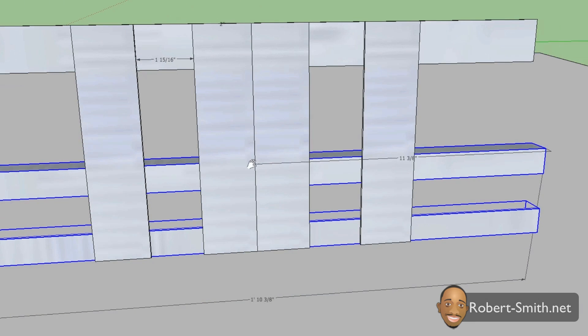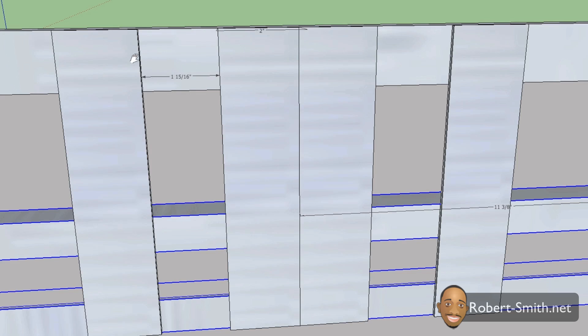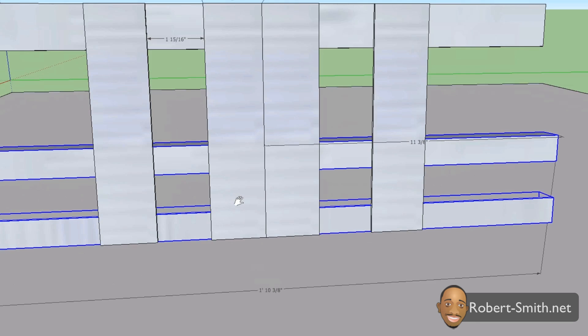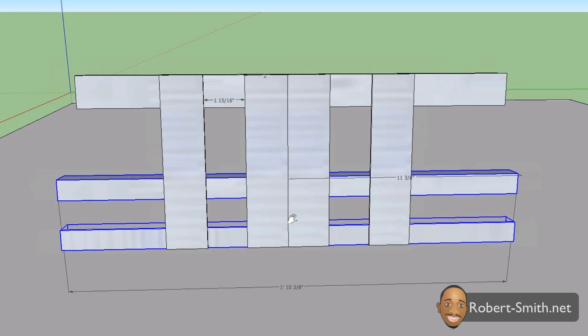For the two far-out pieces, I measured where this gap is and where the connection piece starts from this line, so I could get an idea of where that piece goes on the motors frame. It's a lot to think about, but it should be straightforward. I'm trying to explain how to make sure these markings on the top angle aluminum piece correlate with the markings we need to make on the motor aluminum pieces below. It's very important that this is centered, as it could cause many problems down the road.